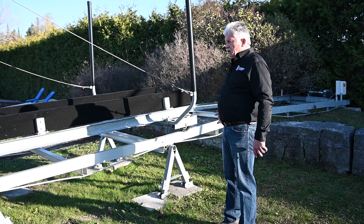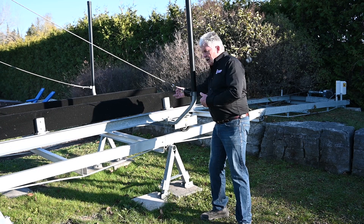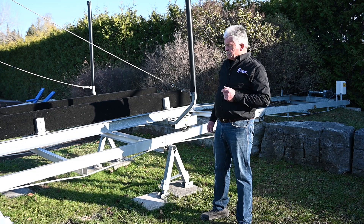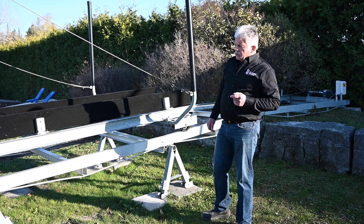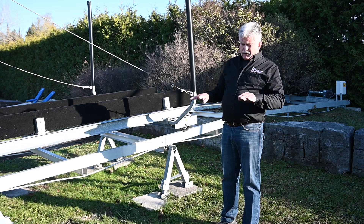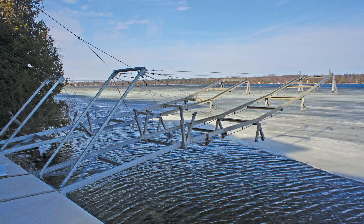Your levelers and guides — you just loosen these bolts and they will widen out or narrow in, same with your bunks. The other thing we're doing a lot of now, because people are getting older, is lift-up tracks. If your boathouse sits 10 feet back from the shore, we have a gantry attachment which goes on your tracks and we can lift up to 40 feet of track, much like a lift-up dock. It just makes life a whole lot easier when it comes to fall and it's time to get the railway out of the water.